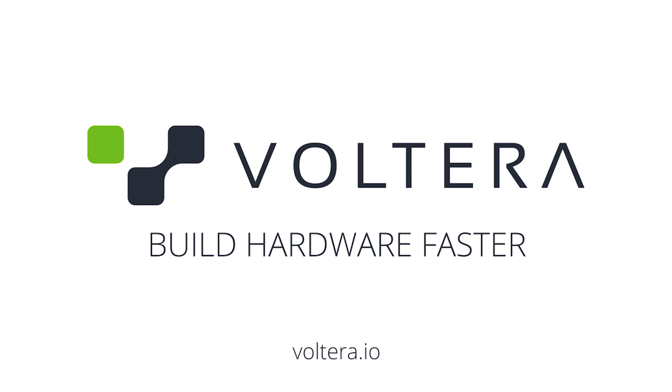Next, make sure you're baking your boards properly — flipping them upside down during baking and leaving them on for the full amount of time. Trying to solder a partially baked board is not going to work. If you're still having trouble, just reach out through the chat and I'll be glad to help you out. Thanks for watching.